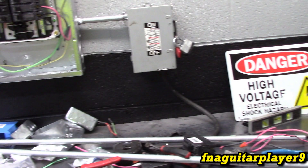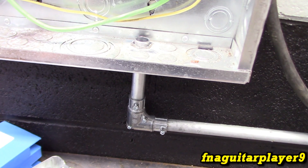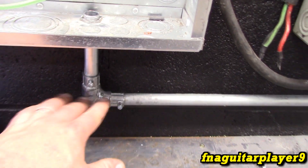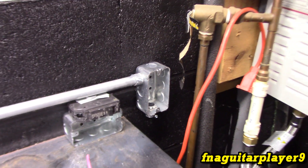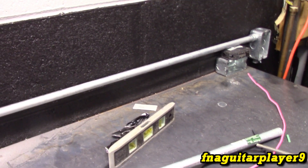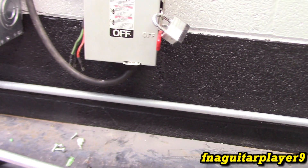You can kind of see how this is going to go - we've got the conduit fitting up here coming down to a pull elbow. It's called an inside corner pull elbow; it has a plate that comes off so you can have access to help pull the wire through, making it a lot easier. Now we've got all the conduit ran. There's a receptacle here that comes down to the elbow, runs all the way down through here behind the workbench into another box where another receptacle will be for the power strips.